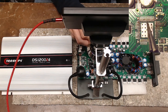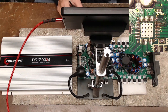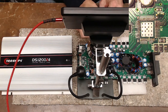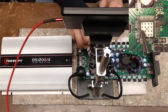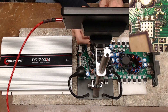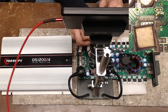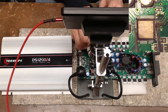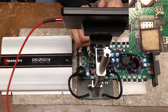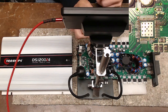You can see how clean the center pad is — that's because the IC was not soldered to the center pad. These 2093s have a really big heat sink on the back. The IC gets soldered to the board; this is a class D driver IC that directly drives the transistors of this amplifier. If it's not soldered correctly, your amplifier is going to fail. You can see there is no solder on the back of that IC — it is bone dry.